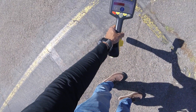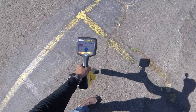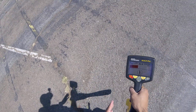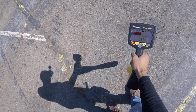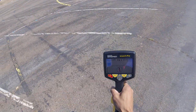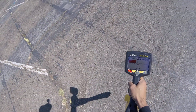This looks like a pretty good signal — it's a red bar graph but with a quick response going left to right, not bouncing around, and the depth looks reasonable. If I turn around and do the same thing to confirm I'm picking up the line and not the transmitter: I'm getting a signal, but if I lift the receiver and point at the transmitter the signal dies down, whereas before when I was too close my signal went higher. That means we're picking up something underground, not the transmitter. We're far enough away that the transmitter is not affecting our signal.